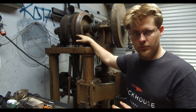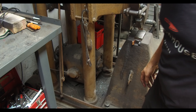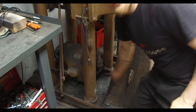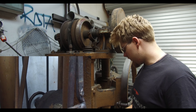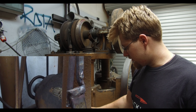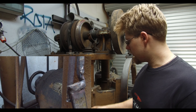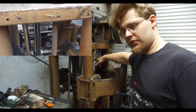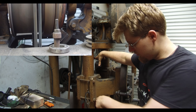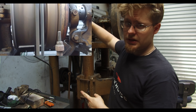Later owners made an electrical modification for this machine to run on a six horsepower motor — you can see it down here. It works by the motor turning a pulley, connected to a V-belt, which connects to the center column that has another shaft with bearing housings and other pulleys. This centerpiece is designed to gear down the motor's speed so the top drum spins at a slower speed.